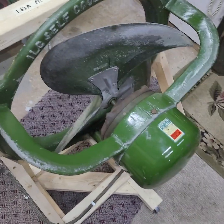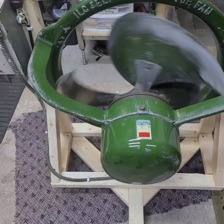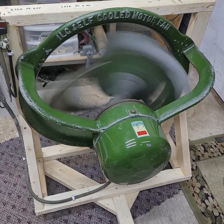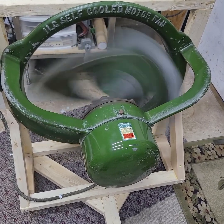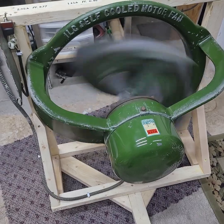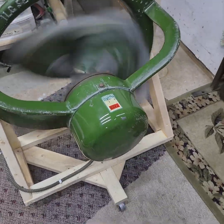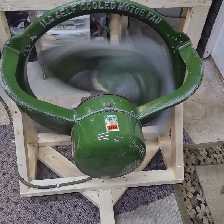I'll start this thing up — here's low speed. I've measured with a tachometer on low: it does around 540–550 RPM. From the catalog, these 243s for the two-speed variety were listed at 855 for high and 600 for low.